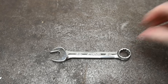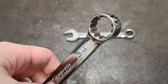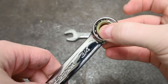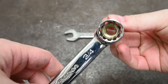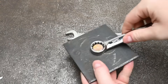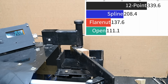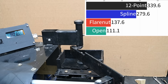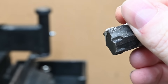And here we have spline. Happy to find it within the same brand — Snap-on — though it's not something I'd normally buy myself. I've always felt spline should have stayed in the hangar. It's marketed nowadays to work on 12-point, hex, square, and rounded fasteners. The feel of them biting into a fastener has always made me go back to 12-point. But let's see it — not swung by hand but by Pushy. The spline box end really didn't want to let go, then suddenly catapulted off the machine after seeing 279.6 newton meters, taking some meat off the fastener — and maybe some off your mitts — at a lower torque than the 12-point.